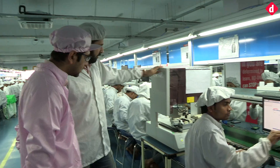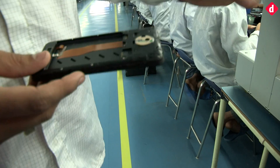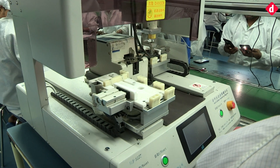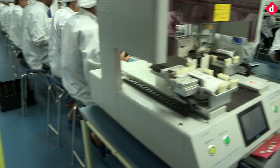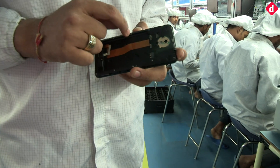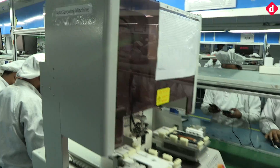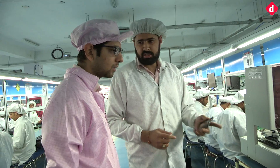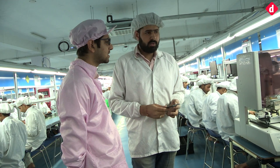This is an automatic screw machine. The screws getting inserted are controlled by programming done by the maintenance department, and then the machine does all the screwing automatically. This is needed because manual screwing is very time consuming and if an operator is not working well there is a possibility of dents, since the screw needs to be inserted in a precise location. With this automatic machine there is no possibility of dents and it takes only six to seven seconds per screw. If the screw quantity is very high, we need two machines, two ports each — essentially four phones getting screwed at the same time.